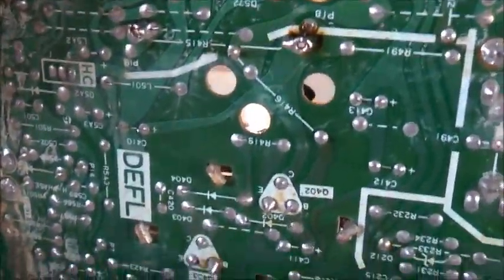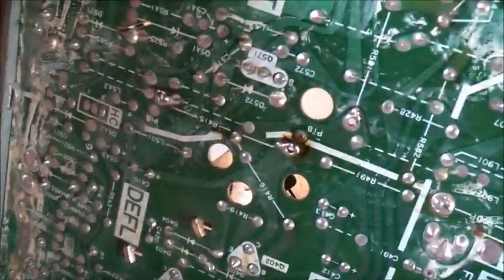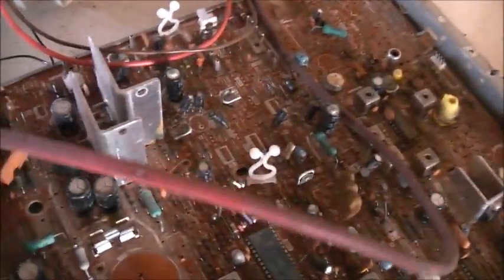And that's the result of Mitsubishi's poor soldering technique. They were really bad back then at soldering. All the flux residue they left behind, or dry joints. It would lose picture altogether, so probably something on the neck board or around the flyback was losing power. I'd tap it, the picture would come back on. It wouldn't fade on, but it would come straight back on straight away, so maybe where it was getting the picture signal, part of the board has a bad joint. What are memories. Nice setup though, I'm definitely going to keep these.